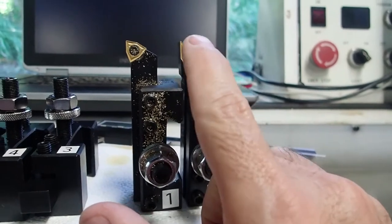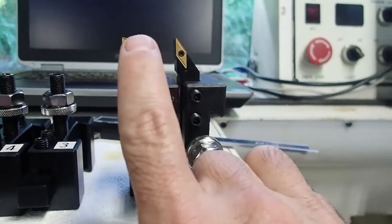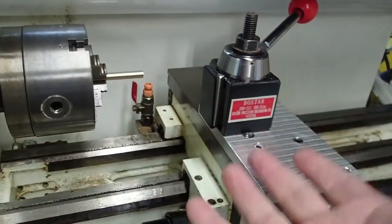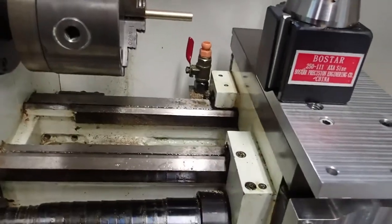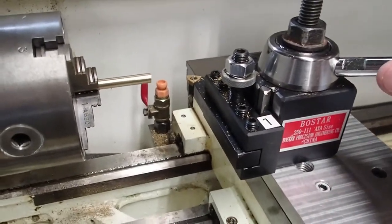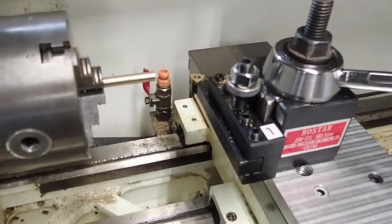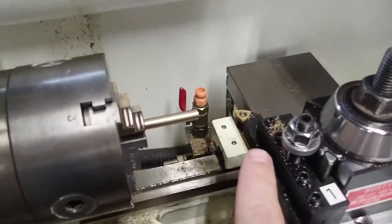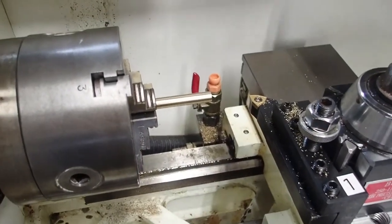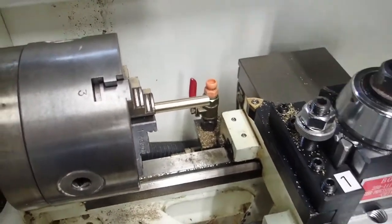So you could actually physically measure these with whatever technique you want and find out what the difference between these two is and type that number in, and that would work. Well, I have an accurate way to measure right here. So I'm going to use the machine to measure the difference between tool 1, which I'm going to define as my reference tool. All the reference tool means is it's simply a tool that we're going to measure all our other tools against. So how we do this is we come down here with tool 1, we touch a diameter or make a skim cut, say, hey, this is the point I want to measure all my tools from, and then simply change the tools